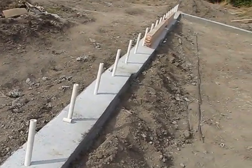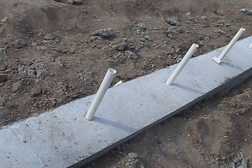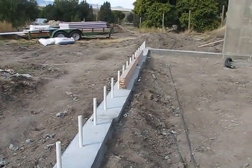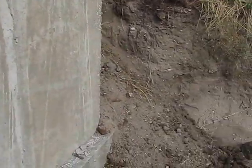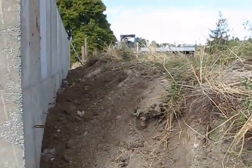I also put these PVC pipes all along this front footing, so all I have to do is glue my other pipes right on top of those and run them over. I did those every two feet. I did an eight-foot retaining wall.